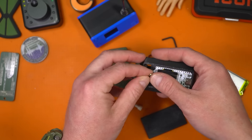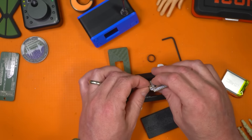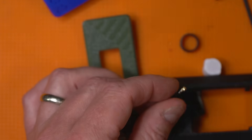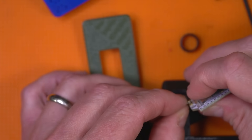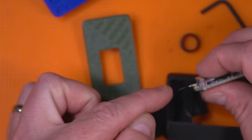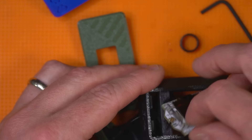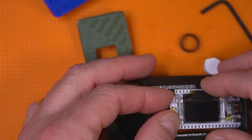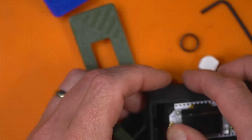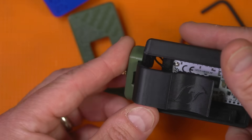Take your antenna connector — it's probably easier to attach it while the Heltec is out of placement. See how small this is? Line it up and you hear an audible click. If you didn't hear it, I promise it clicks. Then line it up again USB side first and set it in place.